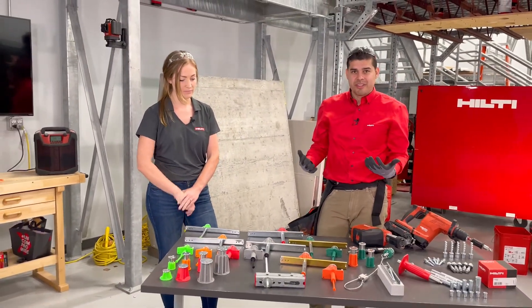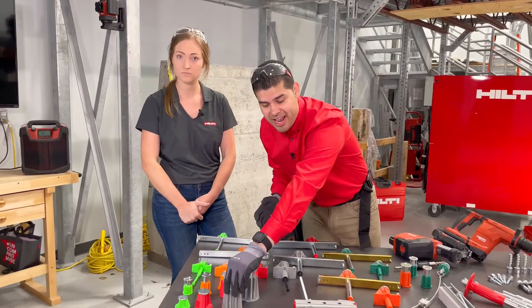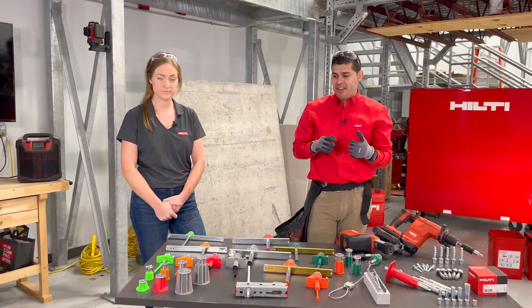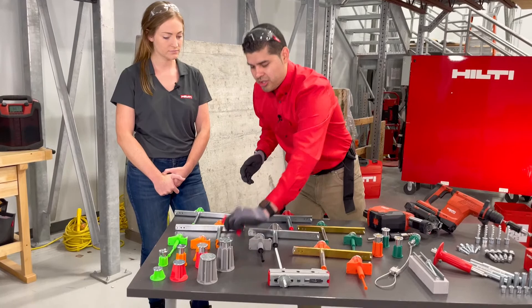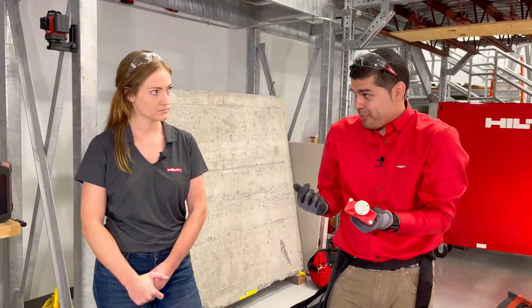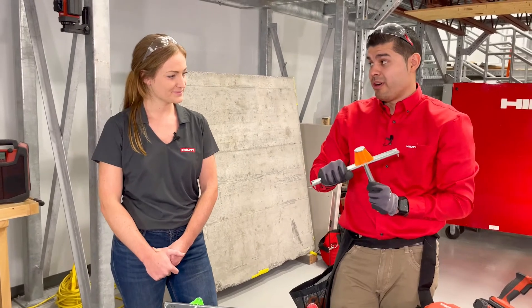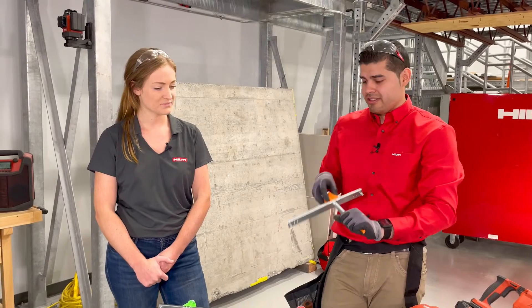Different base materials as well. These Quick Cast single point inserts come in pan deck, wood form deck, and also metal deck solutions. For the metal deck solutions, concrete is poured over the metal deck and there are different valleys. There are short plate anchors, which come pre-assembled with screws for productivity, and then long plate solutions that come with a pre-assembled bar that can span the actual valleys.